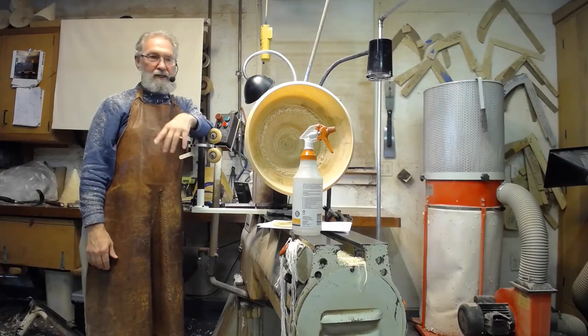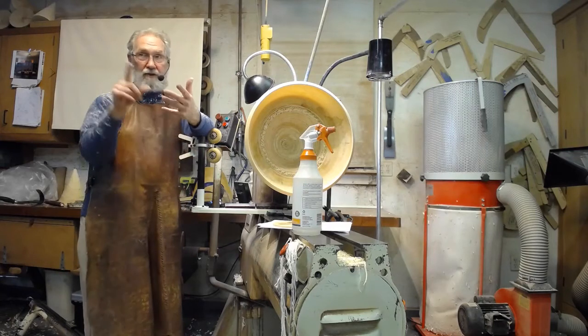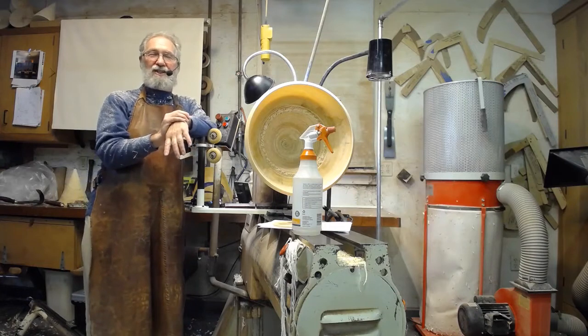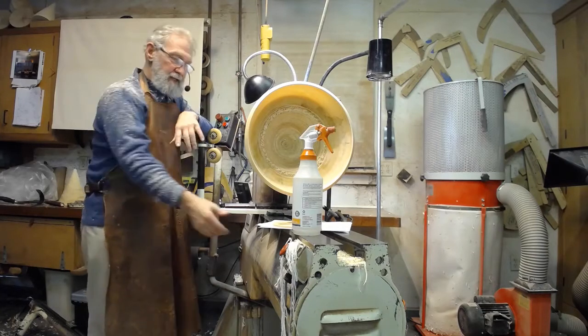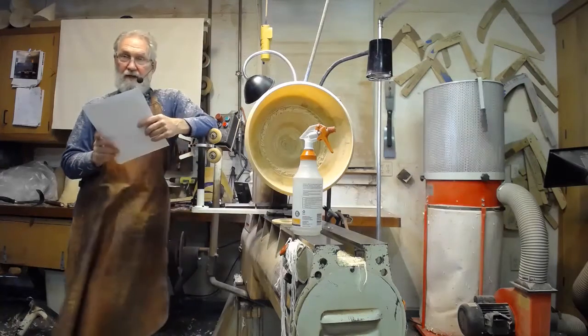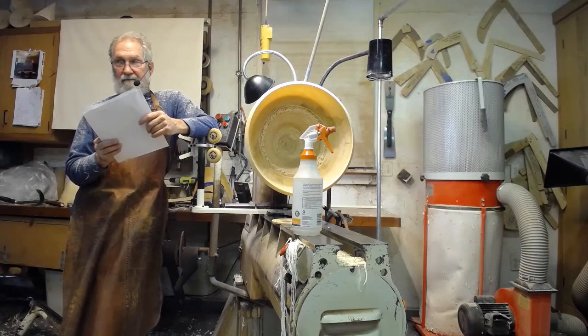Three coats of finish, and then I have to make sure that that finish is completely... Oh, if you do use that finish, you should wait 3 days between coats of finish. It'll seem dry, like in an hour, but to polymerize it has to take more time. If you use it slowly, that can be a problem, but I use it pretty quickly.